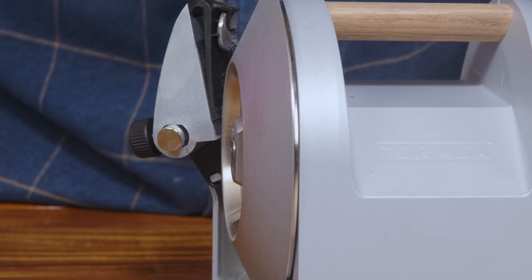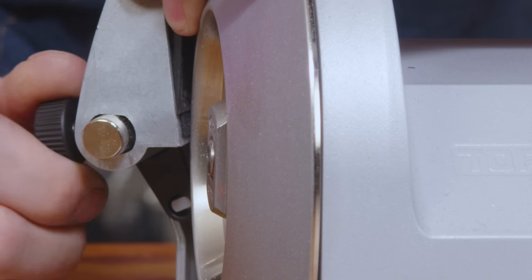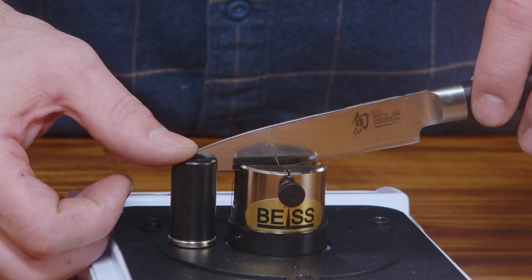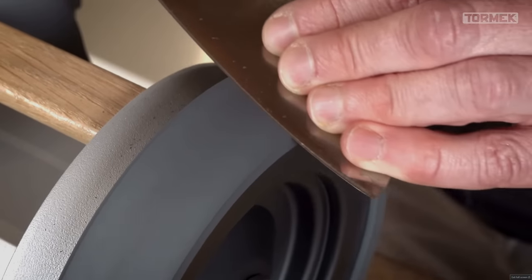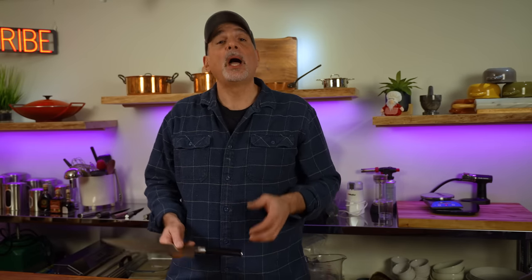Let's see how it does with the paring knife — I'll set it to 10 degrees. When I set it to 10 degrees, the plastic came in contact with the wheel; the whole thing moves forward and it gets uncomfortably close to the sharpening stone. Off camera I measured 484; let's see if we can do better — the result was 326. After watching the Tormek demonstration video online, I got excited seeing them sharpen a Japanese-style knife. I never sharpen my Japanese knives on any machine — I use waterstones. After using this machine, I'm pretty confident it will sharpen my Japanese knives. If you'd like me to do a video about sharpening traditional carbon steel Japanese knives, leave a comment.